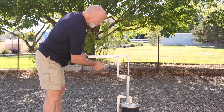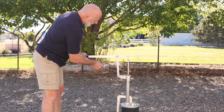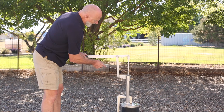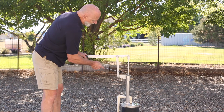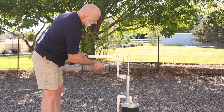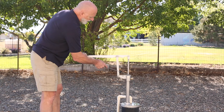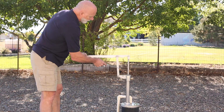There's a rod gland in the pump head here that is made from food grade PVC. It's 8 inches long so it extends down to about there, and it guides this rod over 8 inches of the rod's length to keep it from racking. There are two seals — U-cup seals, Buna rubber — in the top end of this rod gland, and they seal upon this rod.